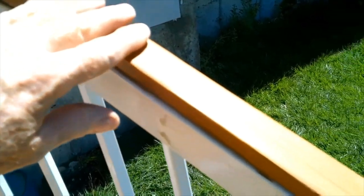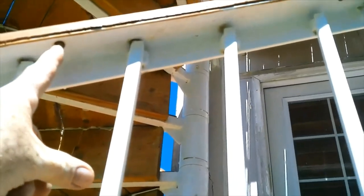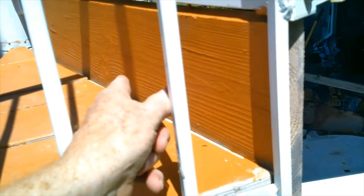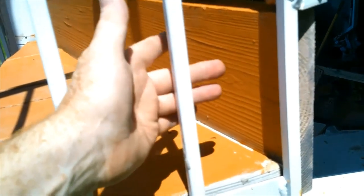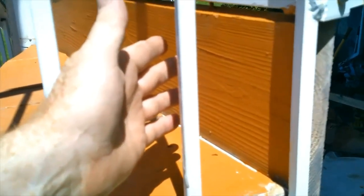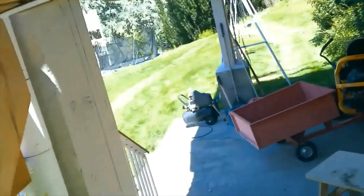The actual railing is wood that was compound cut on a miter saw, sanded, and originally stained. After the stain wore off it was painted. The wood railing is held in with screws per section. My original design did not call for a toe kick, but because I had small children living with me at the time I didn't want any gap where they could fall through or crawl through. Covering these up was pretty simple — it just took a 2x8 fastened from the top down with a couple of screws and also fastened from behind with a couple of screws.